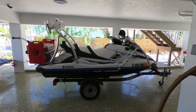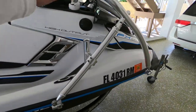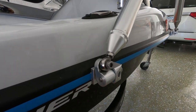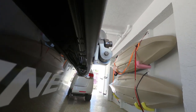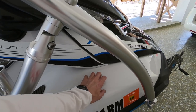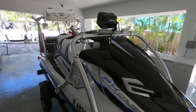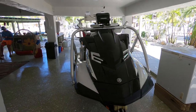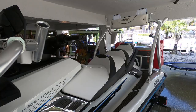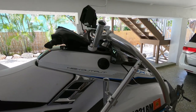On the FX setup we've gone above and beyond. The arches that are put on here are by Fish Master and we've bolted them on the side so that you can put washers or plates on the back. It's by far a more secure way of doing it rather than bolting through the fiberglass and just using 5200 to secure it. You can put the rod holders on wherever you like. Even if you didn't go through Fish Master for the arches, you can still have someone fabricate them at a T-top shop or an aluminum welding shop.